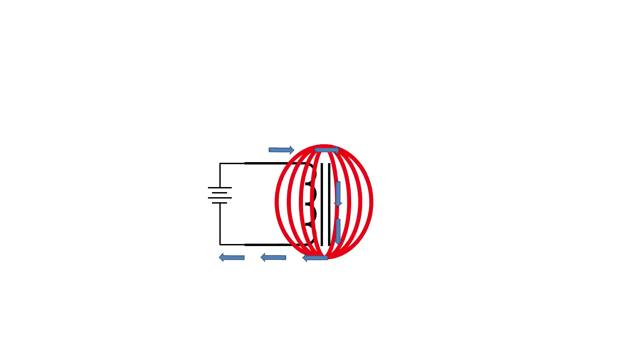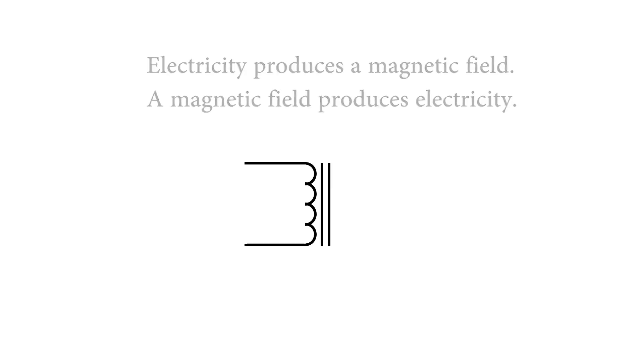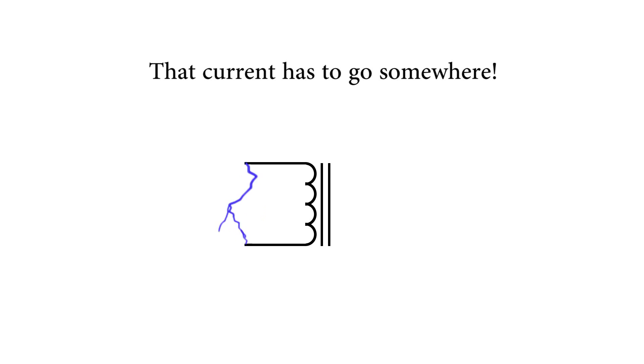Here's a little gotcha with relays. Because they work on a magnetic field, they have some inherent problems. When you apply current, a magnetic field is quickly set up around the coil, but when you take the current away, that collapses and induces a current back into the coil — sort of like a generator. Either that collapsing field induces a current so large that it actually arcs across the contacts of the relay coil, or it induces a huge voltage spike into the circuit — unless you give it someplace else to go. That's why in almost any relay circuit, you'll see a diode inserted — that's the path that gives that spike someplace else to go. When that field builds up and collapses, the voltage it generates can circulate through the diode and is dissipated harmlessly.